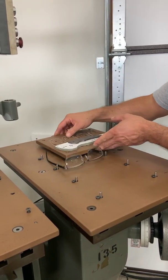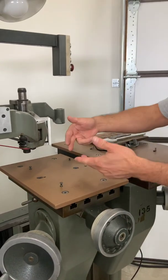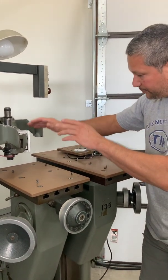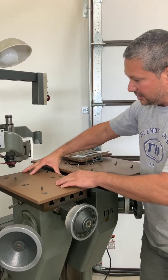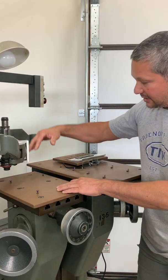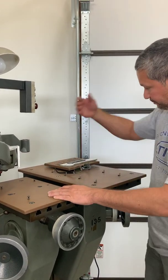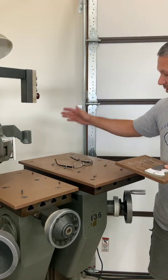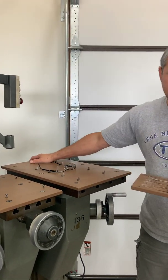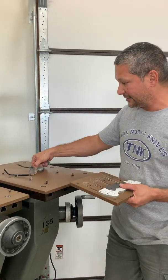What that allows me to do is I can take the plate off, drill, do whatever I need to do, then put it back on the cast iron table, butt up against the pins, and it's secure. It repeats it back to zero again. Same thing with this — I could take this plate off, butt up against the pins, and secure down the table. Now this table is back to zero.